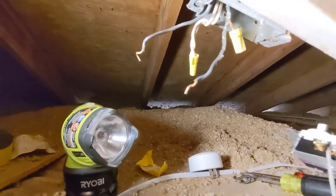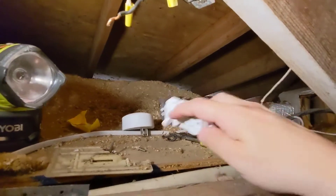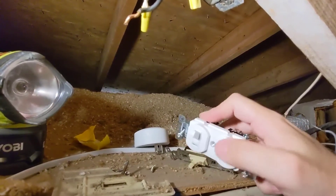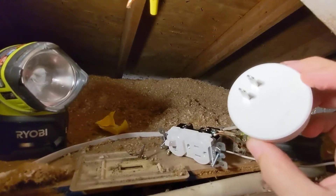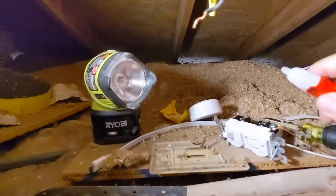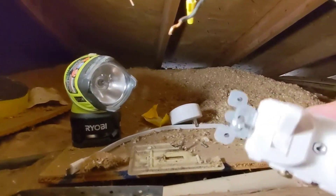What you see here is an outlet-switch combo — a switch on top and an outlet on the bottom. This will take the place of my old switch. The switch part will still turn on my attic light, while the outlet will allow me to plug in my outdoor Nest camera without bringing the plug inside the house or drilling holes through the ceiling. Since I already know which is my power wire, I'll go ahead and turn off the breaker again, test it to confirm, and then we'll show you what we're going to do with this.